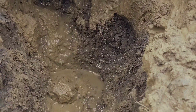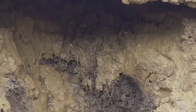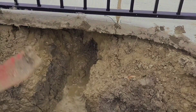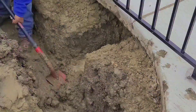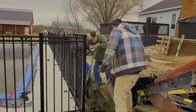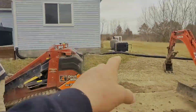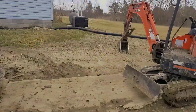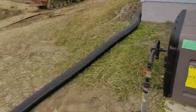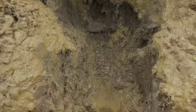You can just see the water pouring out — look at that sand slurry. When you dig in clay, cut it out to pour concrete, and put sand or leveling stone underneath, you just gave water a place to lay. In a warm climate the subsurface becomes saturated and a heavy truck can crack the driveway. In the north, all that water laying in that pocket of sand or stone is going to freeze, expand, and the hydraulic force will crack the concrete — I don't care if it's 4,000 PSI. I highly recommend a good drainage system with any new pour.